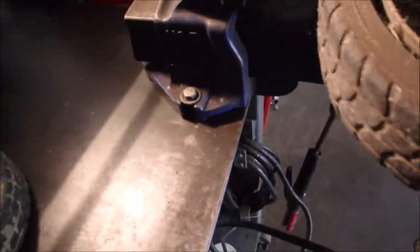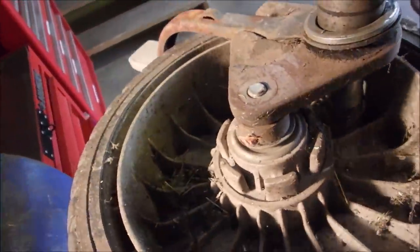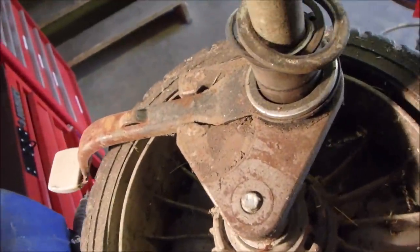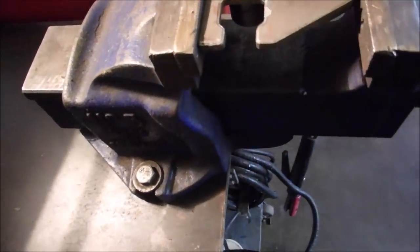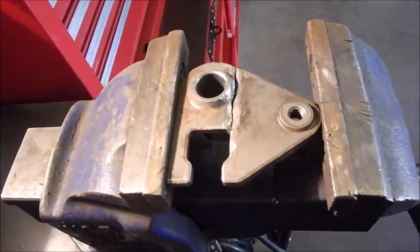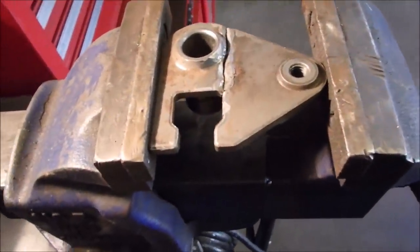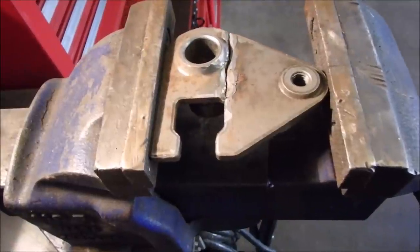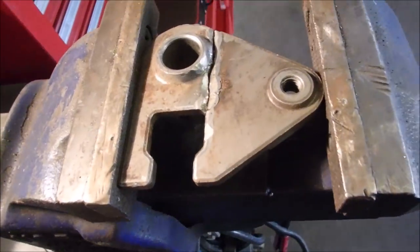of this one, right there. And it broke right in the center, across that way, which is that break right there. I'm going to try and weld it with AC weld 6013, probably somewhere around 95 to 100 amps. But I'm going to fiddle around first. I don't want to just attack it with the welder. That's not what you do. You do a couple of test shots. And we'll just put you up here. That should work.